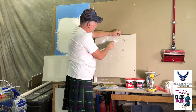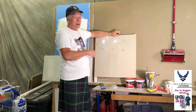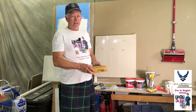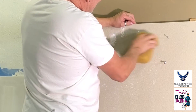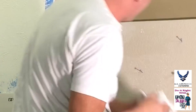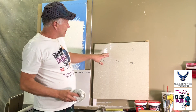What most people do is sand it down to there. I'm going to show you another step you could do instead — after sanding, get a sponge with some water in it, dampen the spot, and just wash the compound almost completely away. You can see now it's disappeared — I can't even tell where that hole was. So that's one way to do it.